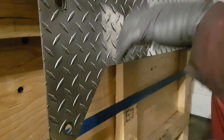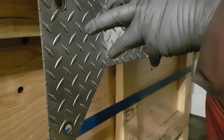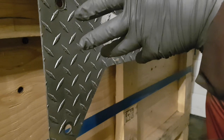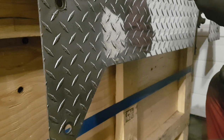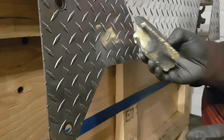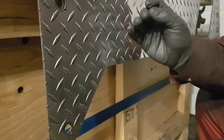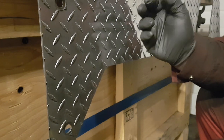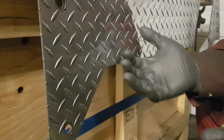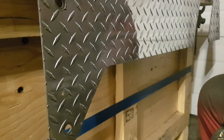Now, what this does is it gives it a gloss while still cutting the aluminum. If you look at it like sandpaper, the brown is like a 120 grit, where the yellow is more of a 320. It also gives the aluminum color. And when they talk about coloring in polishing, it's basically your gloss, your reflection, the mirror-like image that everyone is shooting for.